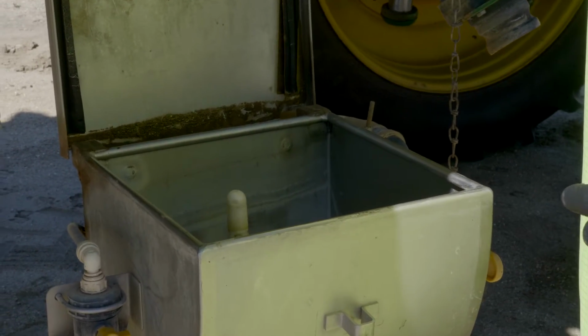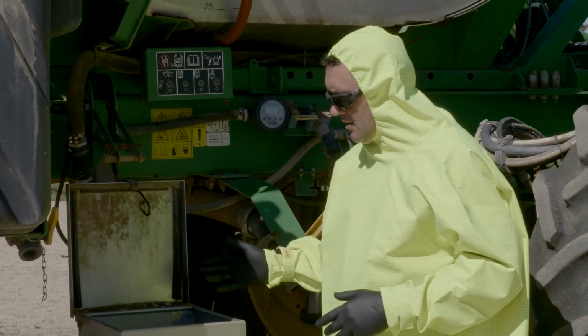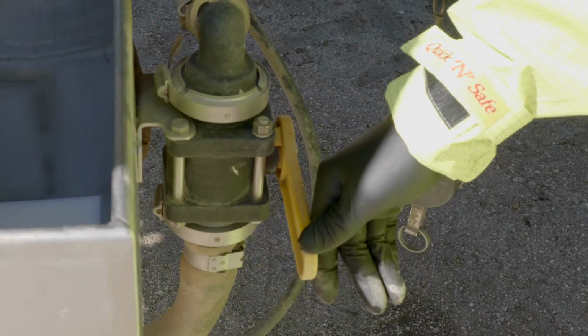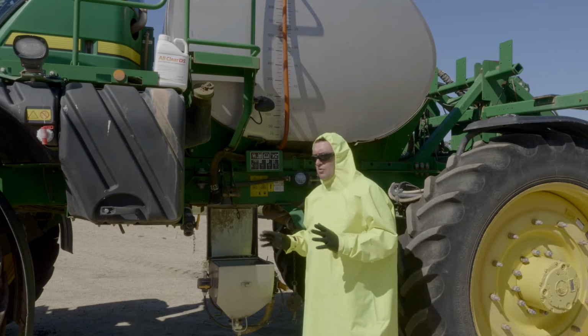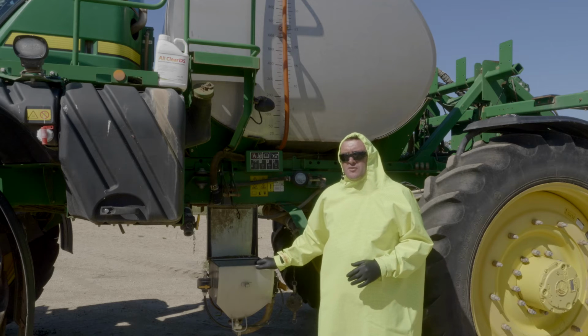So when we're decontaminating the hopper, we want to cycle all the systems, all the taps, run cleaning agent through it, any of these pipes and taps, and also activate the drum rinsing nozzle. Once we've purged the hopper, by all means then put the cleaning agent through the hopper as you're filling the tank to get it into the main spray tank.